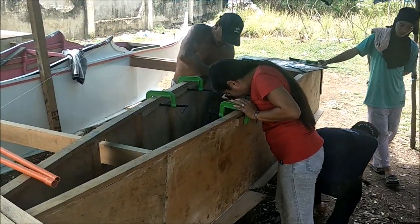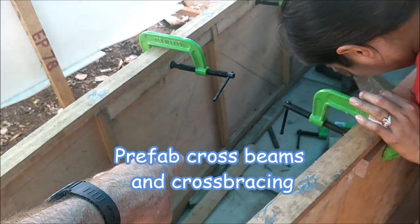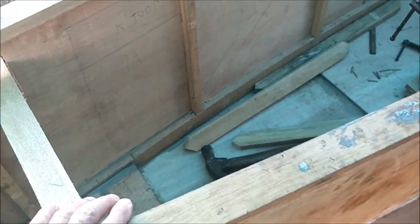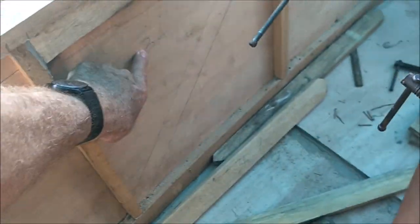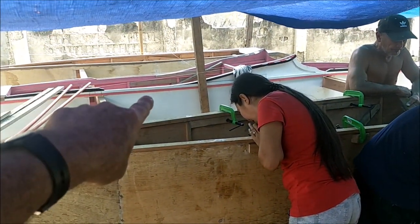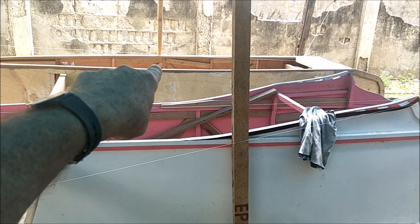We got the whole crew back now. What we've done is basically made a prefab boat — we cut all the pieces for all this cross bracing, all the pieces for all of the supports and everything, and then we label them. This first hole here is hole A, the far outer hole is B, and the center hole is C. So when we mark these parts they're labeled one-A, two-A, three-A for hole A, or one-B, two-B, three-B for hole B.